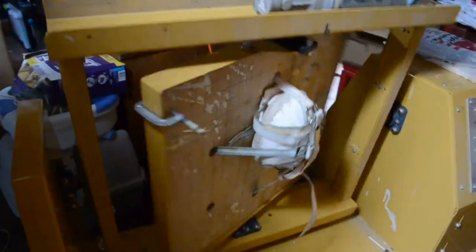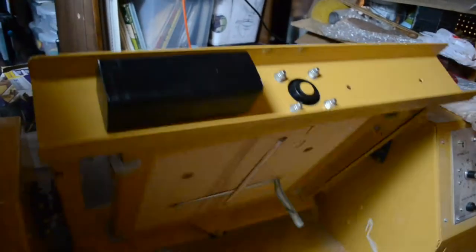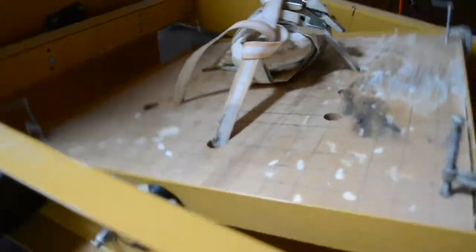This time I loaded up the mold with another batch of resin, after it was powdered and assembled. And this time when I assembled it, I did something a little bit differently. I not only used the mold straps from side to side, but as you can see, I also used one front to back. I then clayed in around the edge